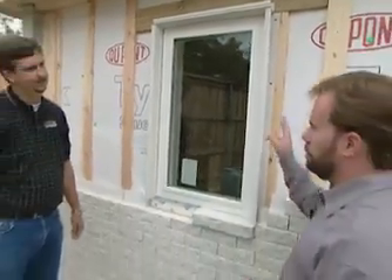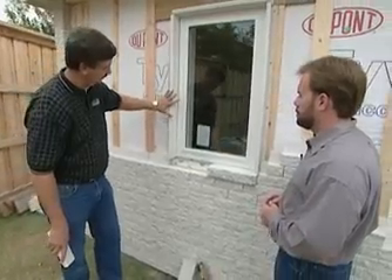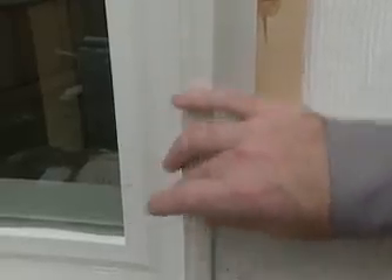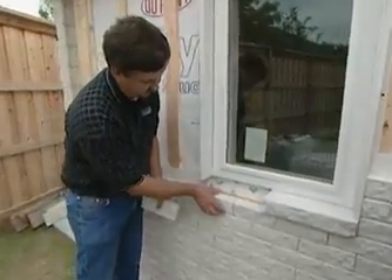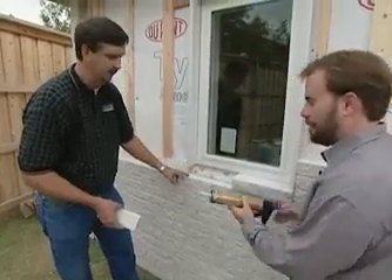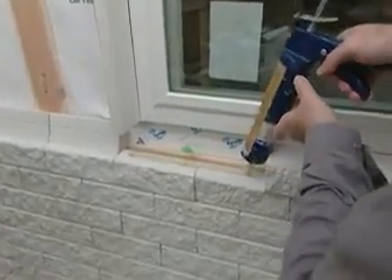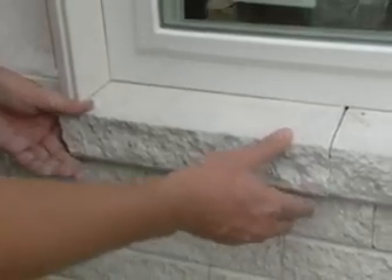Around windows and doors, a vinyl window trim is installed — it comes in white and is paintable. The brick slides right into that trim, which can hide up to three-quarters of an inch of cut, so all cuts are behind the lip and never visible. For the window sill, a normal piece is cut so just the face remains and inserted at the base of the window. Adhesive is run along the top to firmly hold it in place. Once finished, a bead of caulk goes all the way around the window.